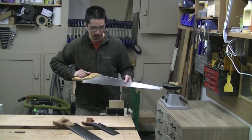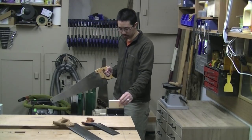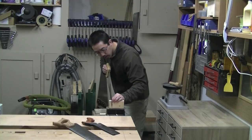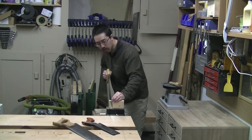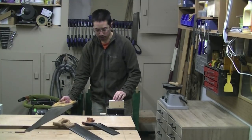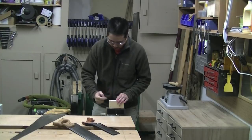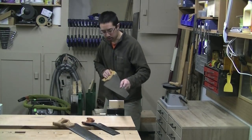I'll use this rip saw as a good example to show how the saw cuts and why beginning woodworkers struggle with this type of saw. I've got a piece of material clamped in my vise. If you've seen someone use a hand saw, it's a very fluid back-and-forth motion — very smooth, very rhythmic. What defines a successful cut, besides the rhythm? Number one, we're sawing on a line to make our board a specific width. We also want to follow a line down the face of the board — two lines total: one on the end grain and one on the face grain.